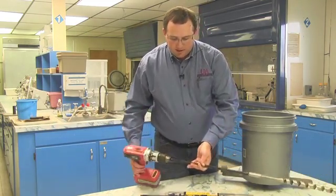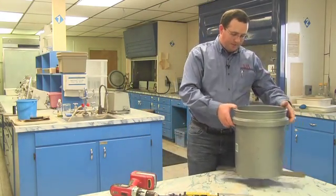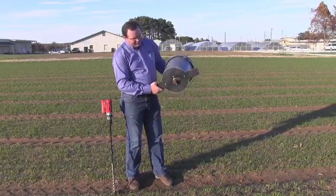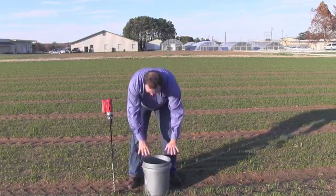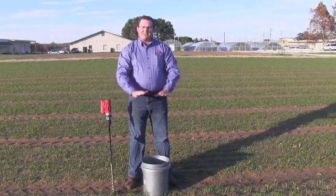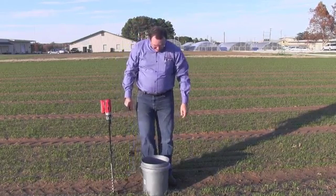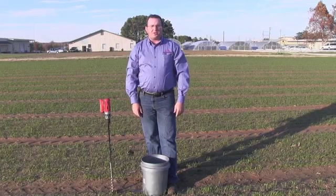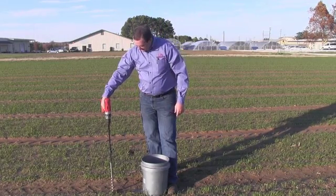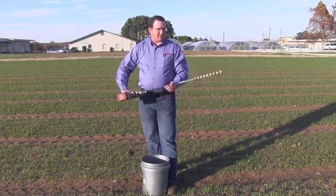When you're ready to take soil samples, take your clean bucket, set it on the soil surface, and push it in to ensure the nipple on the bottom of the plate is pushed down and the plate is flat with the soil surface. Prior to taking a sample, put at least one foot on the foot pad of the plate to stabilize the bucket so it doesn't spin when you generate the torque of taking the soil sample.